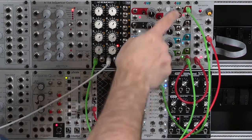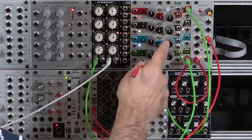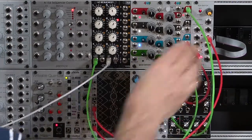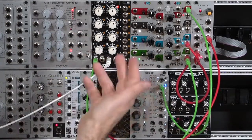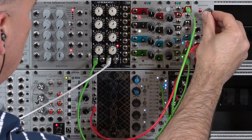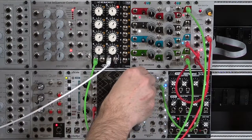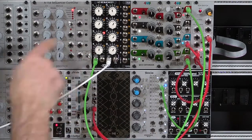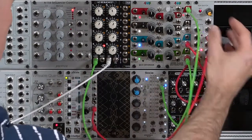To create variations, we need to pull different divisions out of the clock divider. So I'm going to use another one of these divisions, take its output, and run it to one of the inputs of my switch. In this case, I'm dividing by 4 instead of dividing by 8. Since I'm dividing by a smaller number, it's a faster clock. I'll manually switch this to input 3. If I slow that down, you can hear now we're getting two triggers for every step of the sequence. And if I wanted to, I could manually switch between them.